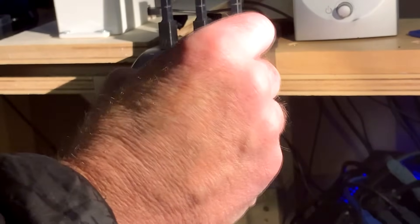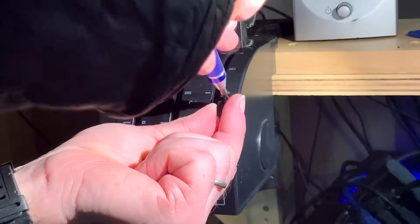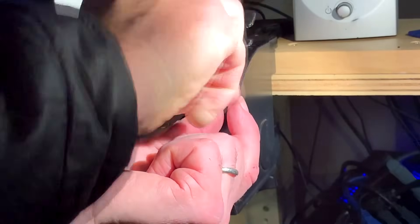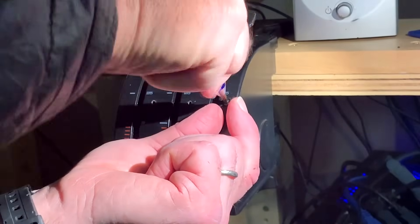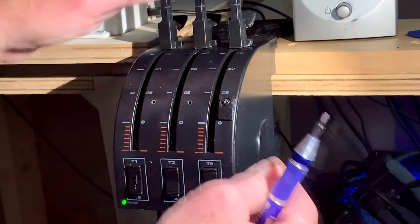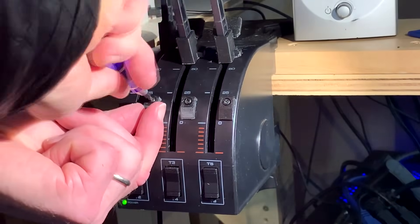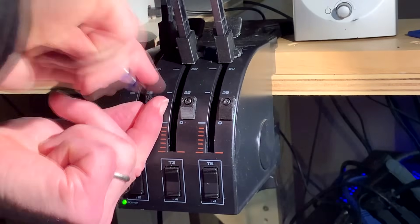The beauty is you don't really do much to your throttle — it's still usable, it's just going to have three new holes there. If you decided to not use this you can always remove those. Screw the blocks in with an M3 screw that threads itself in with the correct hole size, and then install three of those. As you can see, when it comes down it catches and gives you that detent.